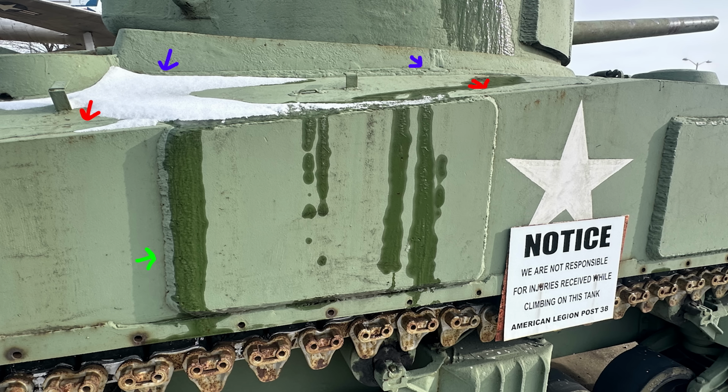Well, one, this tank wasn't tipped on its side when they welded those, so it had to be welded in position. And the rods that they were using, based on the information I have and my own observation, were high in nickel and chromium, and those rods basically don't weld uphill. When you try and weld them uphill, the puddle is so liquid it literally runs like tap water. However, you can progress in an uphill fashion by stacking it like stairs and basically welding on top of a weld and using the previous solidified weld as a shelf.